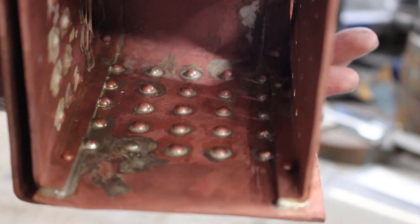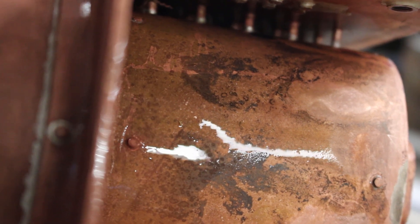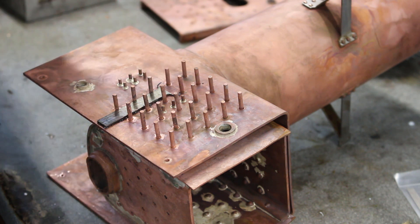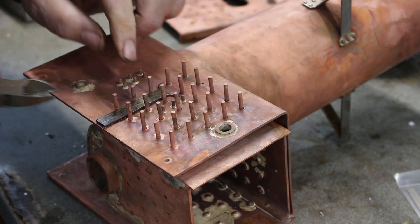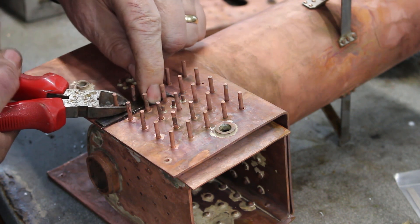On the inside there's some excessive silver solder spread around, but every one looks like it's got a good fillet around it. It looks solid. It's difficult to show on the camera, but when you look down between the two walls each stay seems to have a good fillet on the inside — so I think it looks good. Previously when I was silver soldering these stays I left them long and cut them off afterwards. This time I'm going to cut them short before I silver solder. I've just got a little spacer to keep the height consistent, and snip them off.